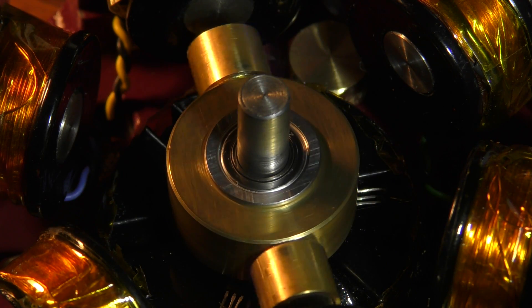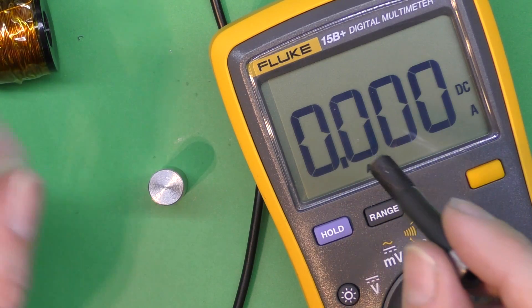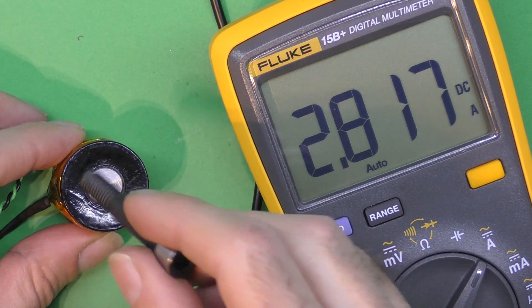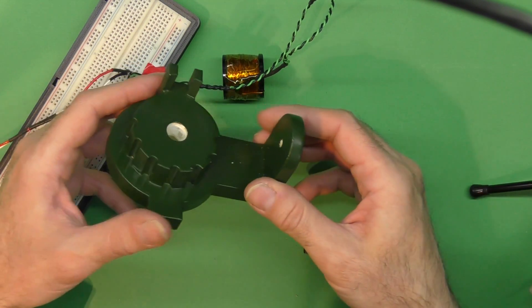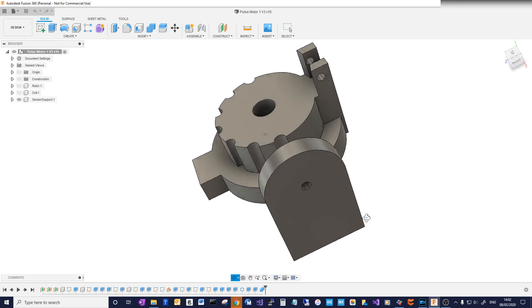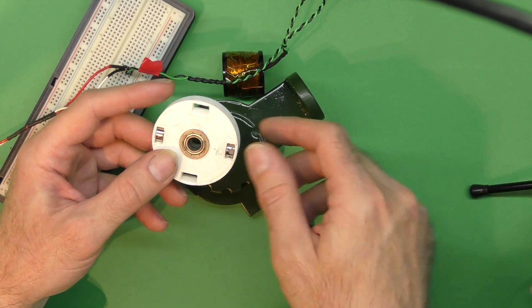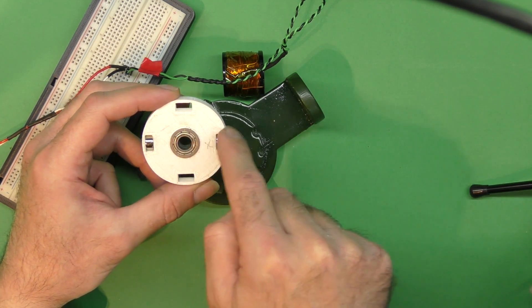I kind of wanted to learn how brushless motors work, I kind of like the steampunk look, and then there are nixie tubes — whether this is really steampunk I don't really know and don't really care. I also wanted to have a go casting a few different aluminium alloys I've not tried before. So the rest of this video is really just the build log of how the whole thing came into reality. If you were paying attention at school, you'll know that if you get a coil of wire, put some current through it and wrap that around a lump of iron, you end up with a magnet — and when you switch the current off, you haven't got a magnet. That's just basic school physics. To have a go at turning this into a first stab at a brushless motor, I've made this thing drawn in Fusion 360 and printed on the 3D printer, with a couple of cheap bearings and neodymium magnets either side.